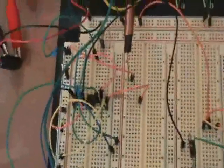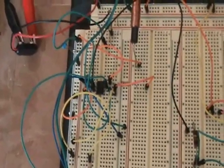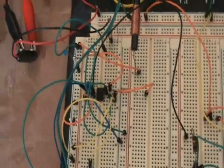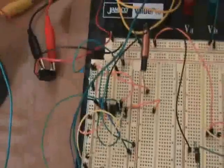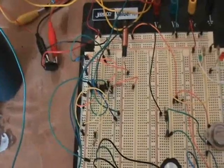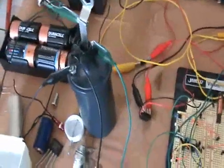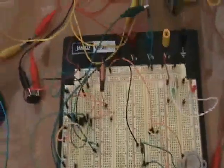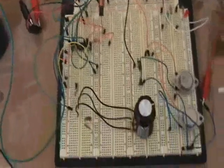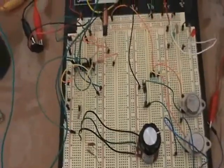I've attempted to replicate this — I have a 555 timer, picked a capacitor and resistors, and I have a potentiometer to dial in a frequency somewhere between one and five kilohertz. The coil seems to be happy at around four kilohertz as a resonant frequency, and the nice thing about being able to control the frequency is you can find the resonance.